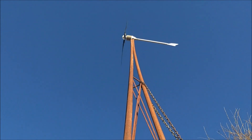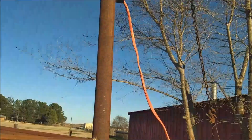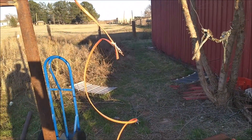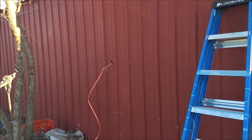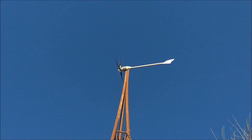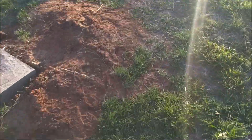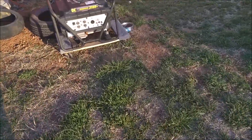Just touching it with the turbine going, there is a little bit of vibration coming through but not much — it's actually running pretty smooth. I've got it wired up with 10 gauge wire. This is not very pretty; it's temporary. I've got to put my disconnect over there. I try to run them all to a disconnect either right on the outside or right on the inside of the wall. I wanted to get it wired up instead of just leaving a break — may as well be making some power.